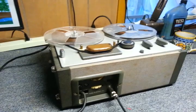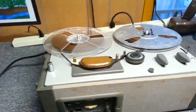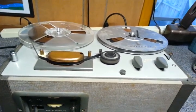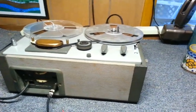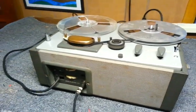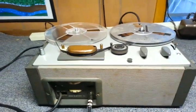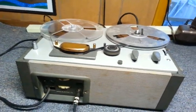I plan to do a little bit more research on ground loops after I make this video, but probably a lot of you have heard of ground loops, especially with hooking up television equipment, maybe, to watch a movie. And you plug in, say, a PlayStation 3 or something that has a grounded plug, and all of a sudden you get this annoying hum. Well, anyway, it was that kind of thing that happened, because whenever I replaced the electrolytics, I had put several of the grounds in different locations. They were all ground, but grounded at different physical points on the chassis, you know, for convenience.